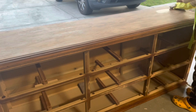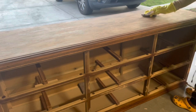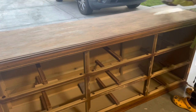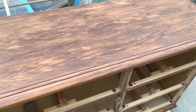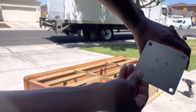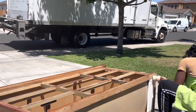The next morning I came out and applied a second layer of stain correctly — doing it in sections — but honestly this just was not up to my standard whatsoever. On camera it doesn't look as bad as it did in person, but I just wasn't okay with it. Even my husband agreed it was pretty blotchy, and he's normally the one who says he can't see it and I'm just exaggerating. So I decided to just prime right on top of this and go in a completely different direction.